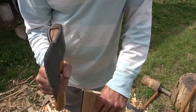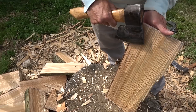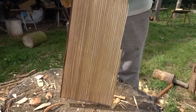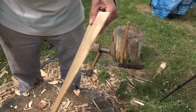This is a side axe — a right-handed one, flat on one side. You can use another axe but the side axe is much easier and enables a method you can't really do with an ordinary axe. The first thing is to take this little bit of sapwood off. I'm just taking the top bit off and then coming down the side, taking it off in a straight line. What's important with shingles is the straight edges, because they've got to butt up to each other. There we have it taken off with the axe — lovely and straight.